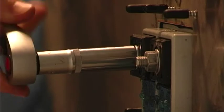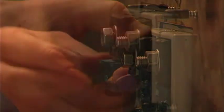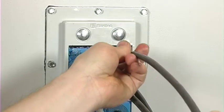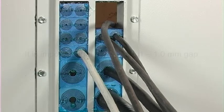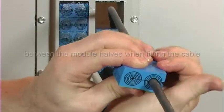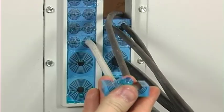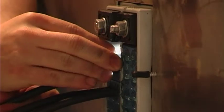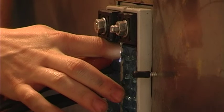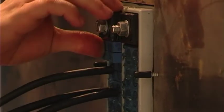Reinstallation: it's easy to add a new cable. Loosen the compression unit nut. Take out a spare module and feed the new cable through the frame. Adapt the module to the right cable diameter and make sure that there is a 0.1 to 1mm gap. Lubricate thoroughly and then reinstall the module. Tighten the compression unit.